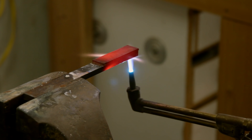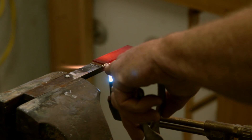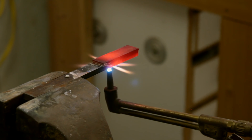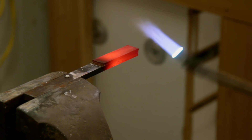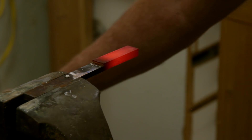Everything's all nice and cherry red and you can see the solder out the back. See how it oozes just a little bit, so you know that it's melted, and I was able to move that piece of tantung around really easily like it's rolling on ball bearings. So at this point you just let it cool down. Don't quench it in water — just let it cool down on its own and then you'll be ready to go to the next step.